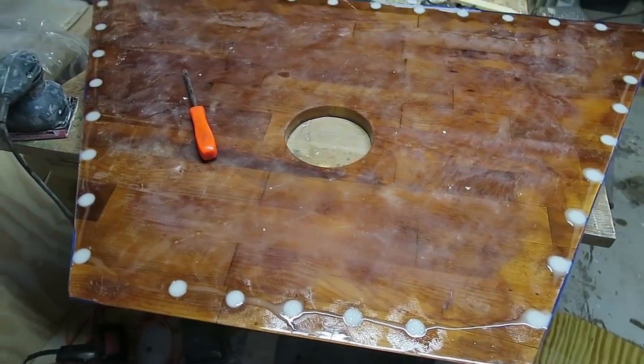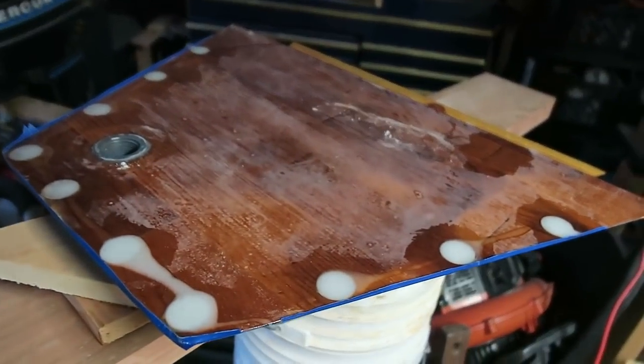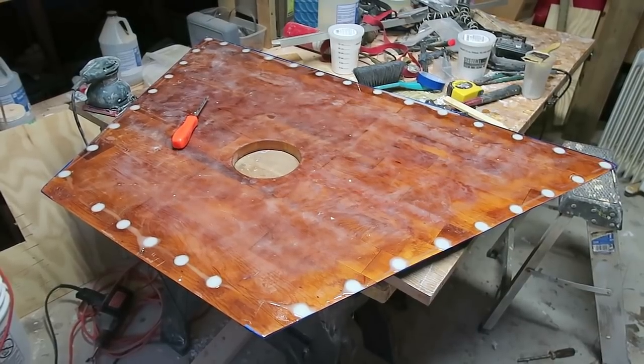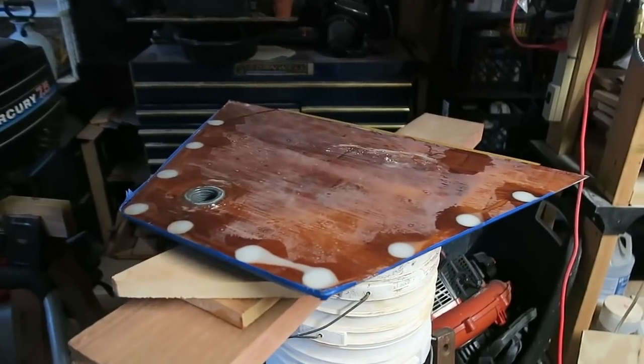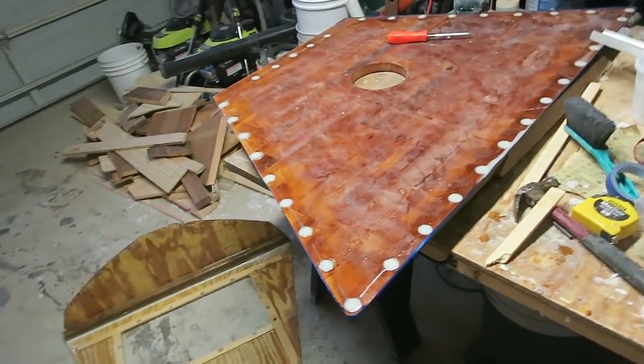And all the holes are now refilled with epoxy that has fiberglass fibers mixed into it. There are actually 50 holes in all, and they are no longer clear. Cross your fingers. Hopefully this stuff is super duper firm and is going to work good for holding hardware when this stuff is cured. Oh please, oh please, oh please. I do not want to drill that stuff out again.